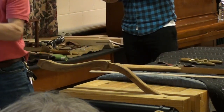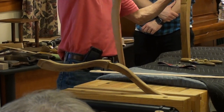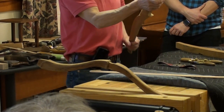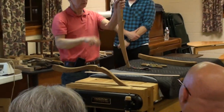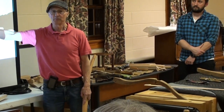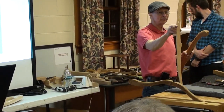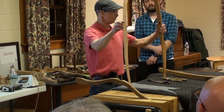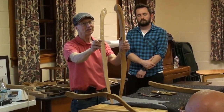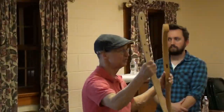This is the leg — not that way — and this is the first mock-up. I just took a piece of ratty wood. Now the hard part on any of these legs on any of my tables like this is that you have mirror images. This goes one way and that goes the other way. This leg is not identical — it's a mirror image. So this leg and that way are the same, and this leg and that way are the same, so you keep those legs together.